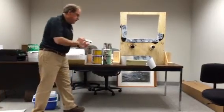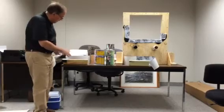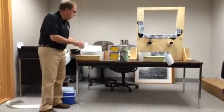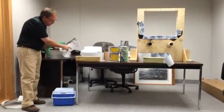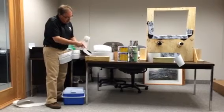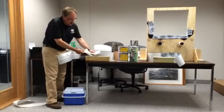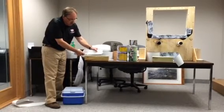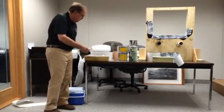The next product is a triple guard energy sill. Now this is when you have a foundation application, as I have my 4x4 here. This is how the triple guard comes to you in the field. You can go down to your local home center or your lumber dealer and buy a standard sill sealer, but you put this down, it curls, it folds. There's no way to really hold it on the foundation before you bring your wall in.